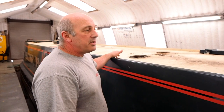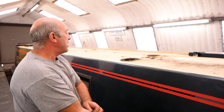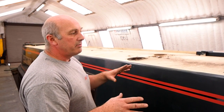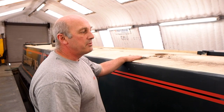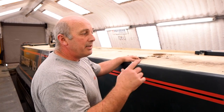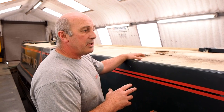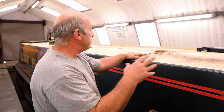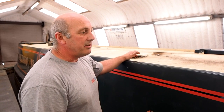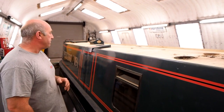We've already identified that not all of the screws are going to come out easily. Some have snapped off. Again, not a problem, but you do need the right tools for the job. You need drills suitable for drilling out these studs, and then you need to be able to re-tap them if you're going to machine screw them back in. So if you are taking on one of these jobs, and we'll show you how to replace a mushroom, it's a fairly straightforward job, but as in anything in life, as long as you've got the right tools for the job. Right tools and the job's easy.